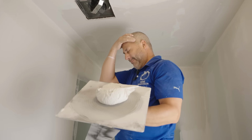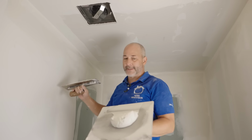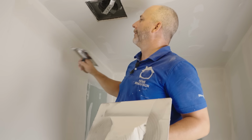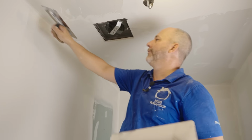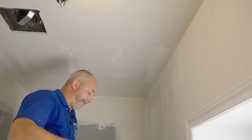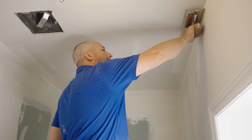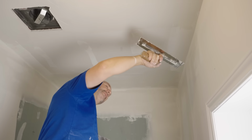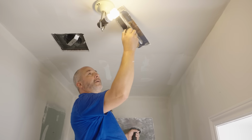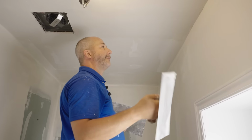Okay. I think I'm pretty much committed to another coat just because of the nature of joining existing. The old inside corner joints are always so thick. There's not a whole lot that I can do other than just apply a few coats of mud over and over and over again to balance it out. Remember, the goal here is not to make it perfectly flat. It won't ever happen. We have a ceiling made of wood with an old joint and a new joint. We've got rounded edges every time you go to the edges. It'll never get perfectly flat. What you're looking for is smooth enough that you can sand it so you can't see the ridges. That is it. This is the art of hiding the obvious.